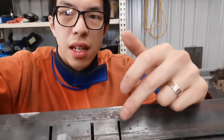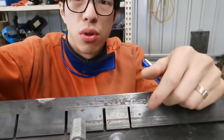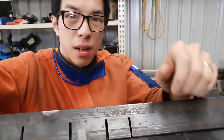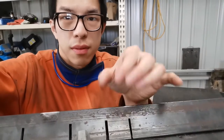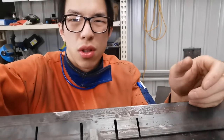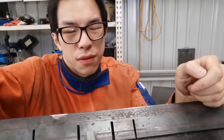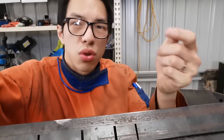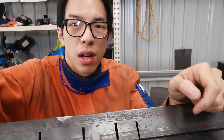So what I did in the middle, I just used the cold cut circular saw and basically ran through it a couple of times, so the finger gaps are wide enough to insert maybe 2.5 mil of sheet in there. That's obviously bigger than 2.5 mil, but it ensures the thickness of sheet metal that can be inserted in there. I'll just use a different camera angle and let you have a look at the die at the moment. All right, just let you have a look.